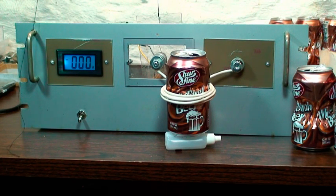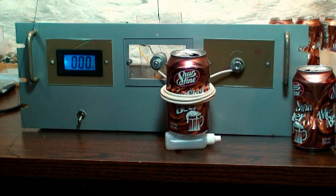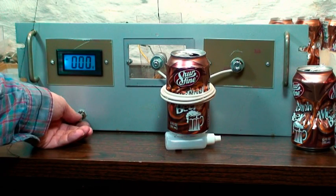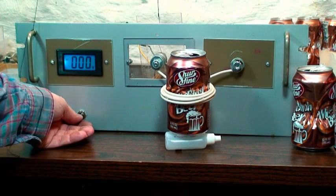Can crusher. What I'm doing is I'm using a voltage multiplier to take the output from the microwave oven transformer and double it into a defibrillator capacitor. In the previous run, I discovered that the voltage divider burned out — it said it was only at 1KV but it was actually at a full 5KV or something in that range. So we've rebuilt the voltage divider now and we're going to be retesting it.